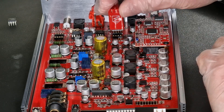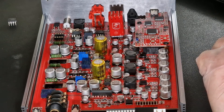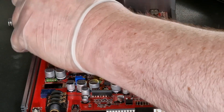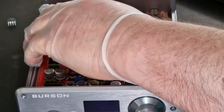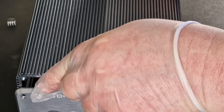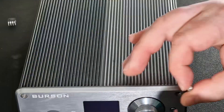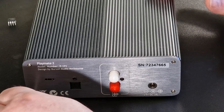There's a groove on the op-amp that matches a groove in the socket — you can see that — and you line those up and push down. The groove on the other one faces the other way, and the V6 Vivid Dual logo also faces the other way. Line it up, make sure it's seated in, and literally it's just a question of putting all the screws back onto the heatsink, remembering that the front has slightly different size screws. Do a quick check and that is it — as simple as it gets.